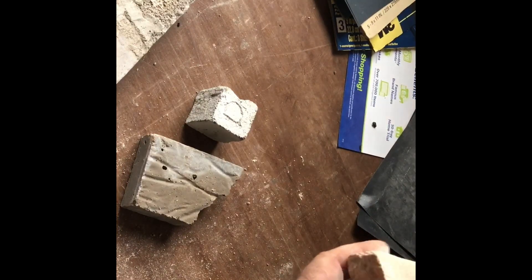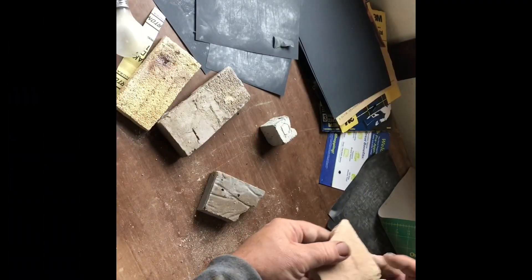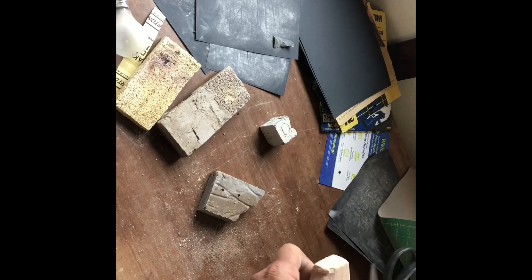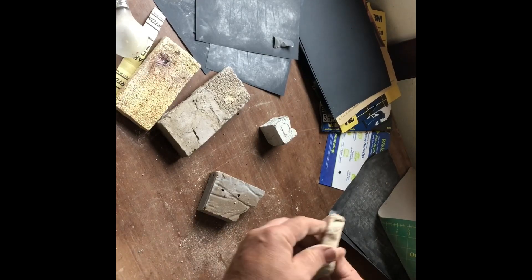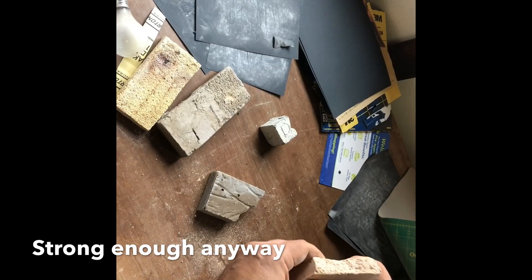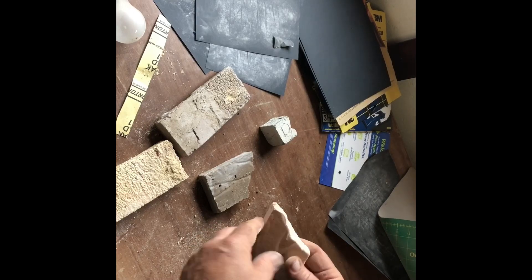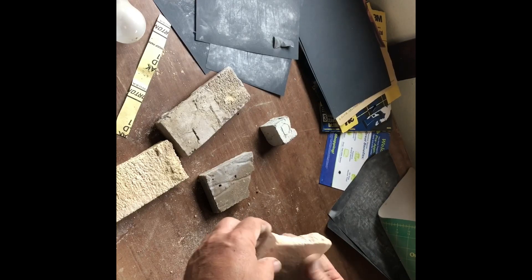I think I'm going to go ahead and make an oven. As for the edges — how crumbly are they? They're not too bad. And strength-wise, it's probably as strong or stronger than the soft brick. It's a fairly light refractory as castables go, so I think that will mean it's got a good R-value and will hold the heat in.